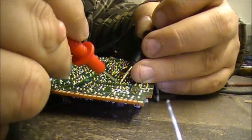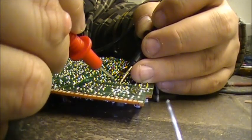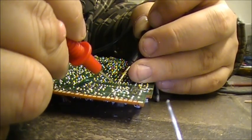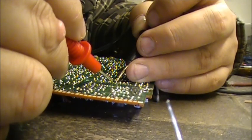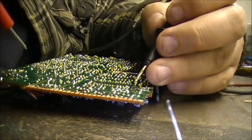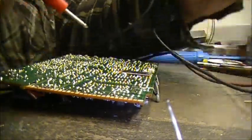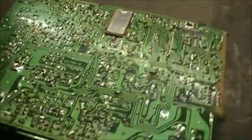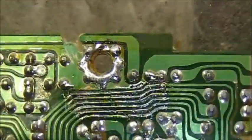Then we go across again. And we know we're good there. Move to the next trace. We know we're good. Then the next trace. You know, we're good. So right now we have no shorts on the repair here at all. No short circuits. So we're good. We are golden. So folks, that is how you repair a broken trace